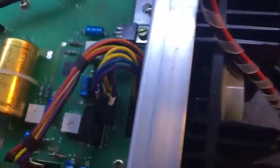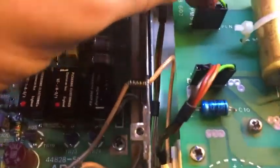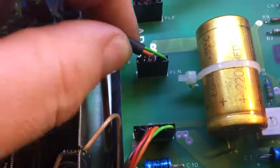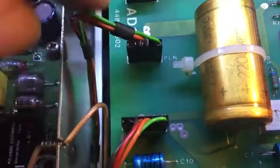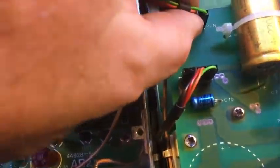It's got a 5-volt regulator at the top. I actually desoldered the wire which is just down there, and put a current meter in series — and it's pulling 3.1 amps. I measured that when I pulled off this plug here, PLN, which runs a lot of the digital electronics stuff in here. The voltage came back — it was dropping down to 3.4 volts or so.